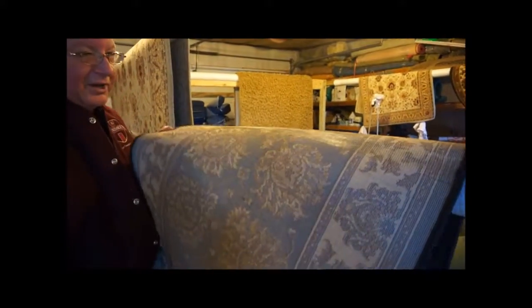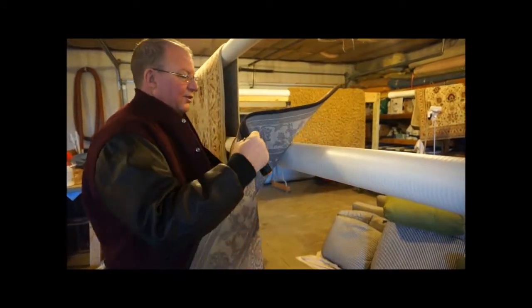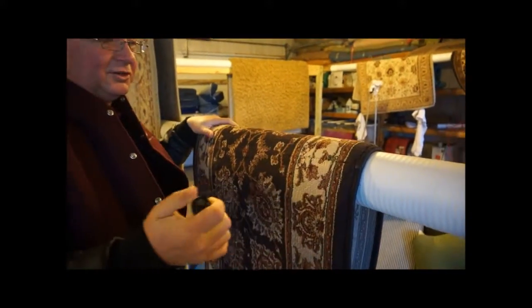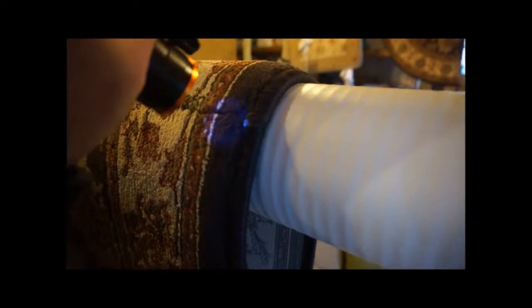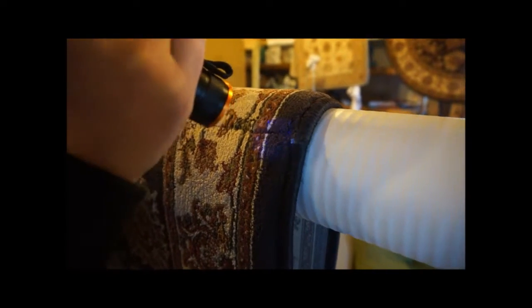On the top side, if this was installed carpeting and we saw a line like this, we'd probably think it was a seam. One way to determine that for sure is to flash a black light on it. You can see that the glue there is fluorescing — you really don't see it without the black light, but when you hit it with the black light it really fluoresces.